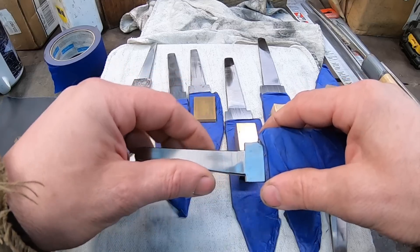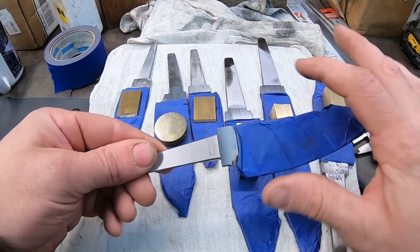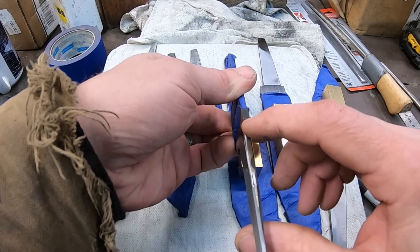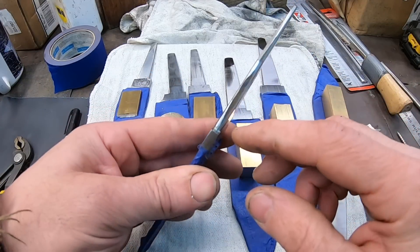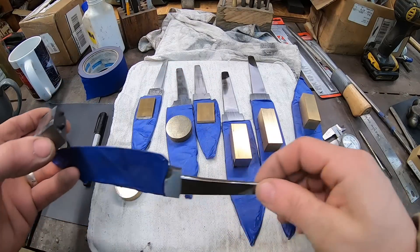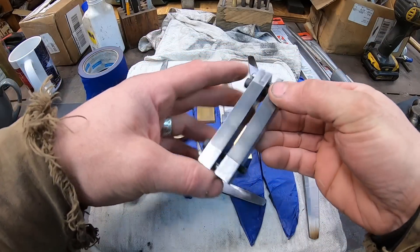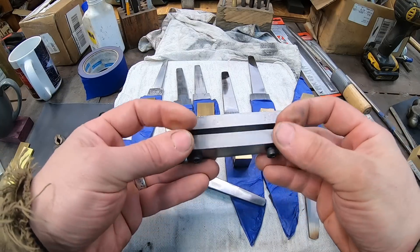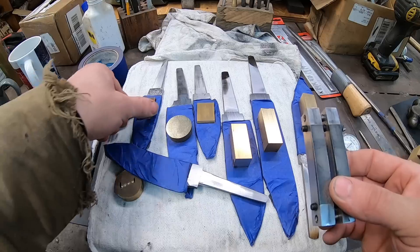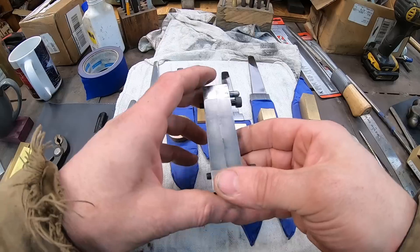That radius is important for minimizing a stress point. Any pressure on the tang — and this is plenty of tang for a blade this size — but any kind of pressure on the tang could result in a stress point if it's at a sharp corner. So I like to radius that out. If you're wondering how to get those nice crisp shoulders, go get yourself a carbide insert file guide. Depending on where you get one, it's between $100 and $150, worth every penny. I wish I'd got one a lot sooner. I wasn't doing as many hidden tang knives with bolsters, but if you're doing any number of those — even one — go get one of these.